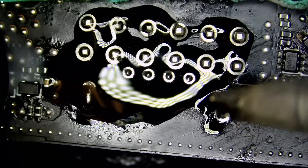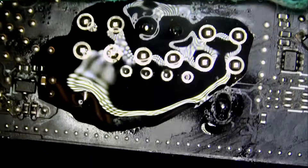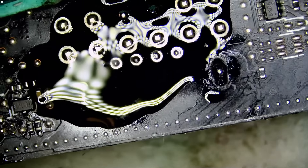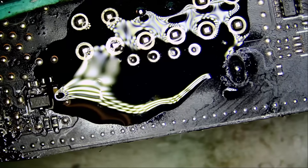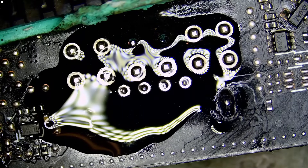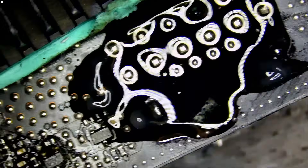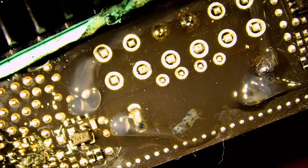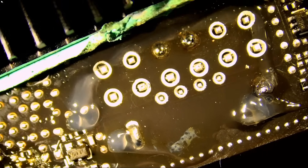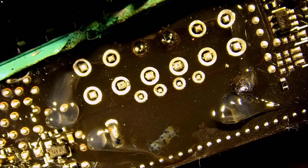I just want to touch up on a few pins because I want that connector to be secured in place. Now I can let go from the bottom — I had my finger under the connector so it's as flush as possible. Now we can use our anti-glare light. You can barely see that we have flux on the board because the anti-glare light cuts the reflections of the board.